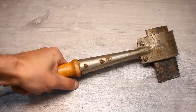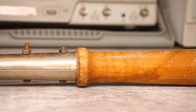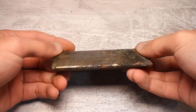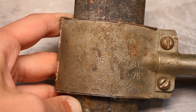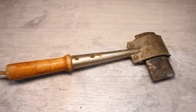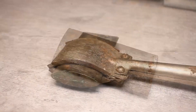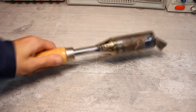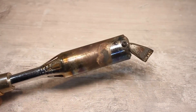This is the so-called hatchet — a powerful soldering iron consisting of a handle and a massive copper block wrapped with a nichrome element. Such soldering irons are used for soldering large parts, for example radiators, and are rarely used in amateur radio work. Due to the massive tip with enormous heat capacity, these soldering irons retain heat for a very long time. This is its modern counterpart — only the form factor is slightly different and the tip is smaller. These soldering irons can have a power range from 150 to 500 watts.